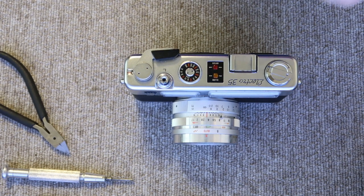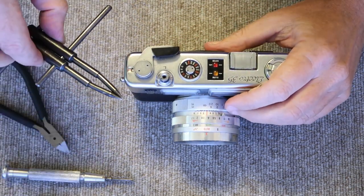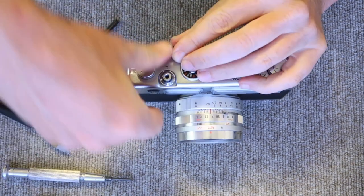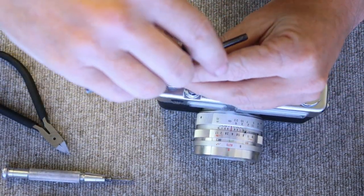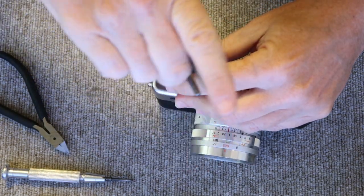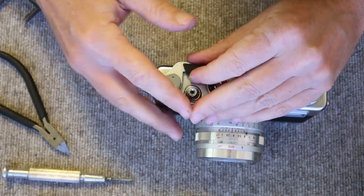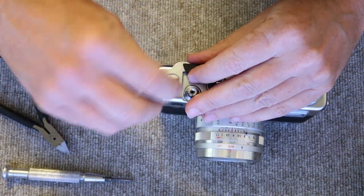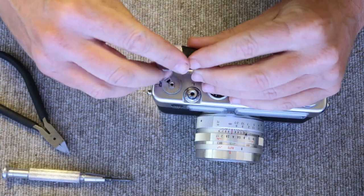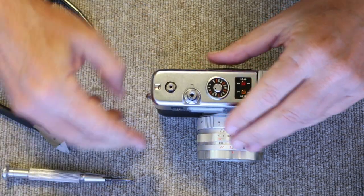Let's go ahead and start. The first thing I'm going to do is remove the film winding lever. I can use my pointed spanner — first I'll try with my thumb. Sometimes you don't need the pointed spanner, but in this case I will. Sometimes it's just on thumb tight and you can give it a good twist and it'll come off. So I'll take off the screw. Underneath the screw will be a compression washer. Under the compression washer is the lever, and under that is a spacer with a slot in it. Set those to the side.